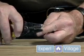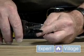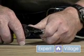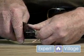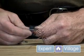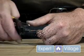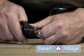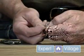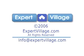Clamp it down. That actually cuts through the insulation, so we've got it cut right down there. And then we pull them apart. What we've essentially done is severed the insulation without touching the wire, and then the insulation will pull off as we slide these to the side. So that just comes right off and falls off. We have a stripped piece of wire. Thank you.